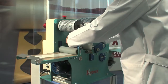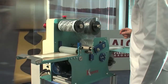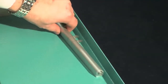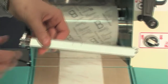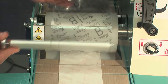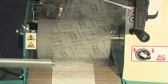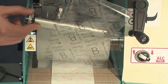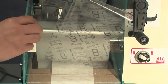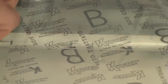Release the tension of the unwinder roller and insert the separation roller. Insert the blade support shaft on the top infeed roller with the blades facing inwards. While pressing on the flange, rotate the shaft in anti-clockwise direction by half a turn until the flange is fully locked.